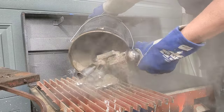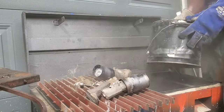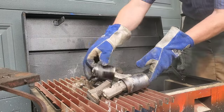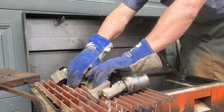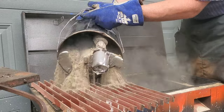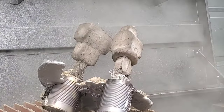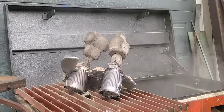Let's take a look at the second batch. This is turning out really well today — I'm pretty happy with all of this and it's going to be pretty easy to clean up when it comes time to machine it all. For pail three, I didn't really have any doubts on that pour because I actually dumped way more aluminum in there than I needed and it looks like it turned out pretty good. The only final step now is to let it fully cool down so we can handle it with our bare hands and take it over to the bandsaw to cut these off.